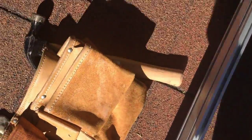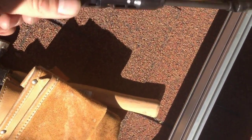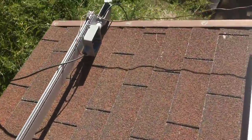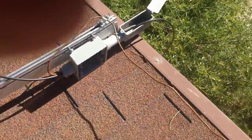Here's the Y-connector I mentioned. When you start series wiring on this array you'll have either a positive or negative remaining — in this case it's the positive. This array is wired identically and I'll have a positive remaining on this side too. So I'm going to connect these two arrays in parallel by taking the positive from this string and the positive from this string and connecting them into the Y-connector. Now I've just paralleled two strings, and this will be my positive DC running down through the junction box.